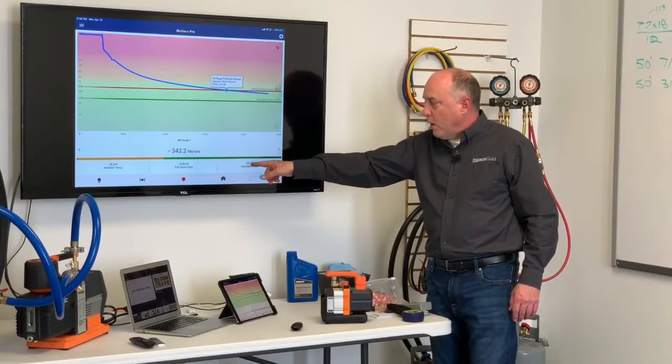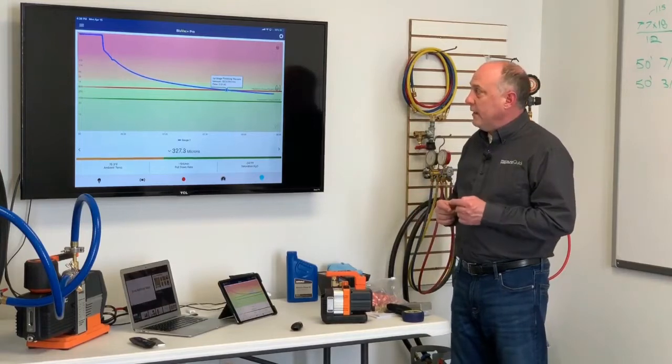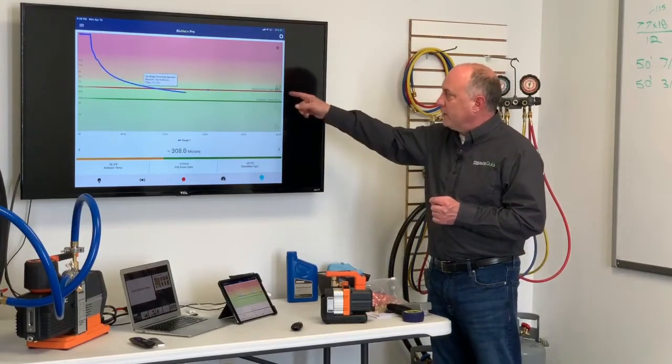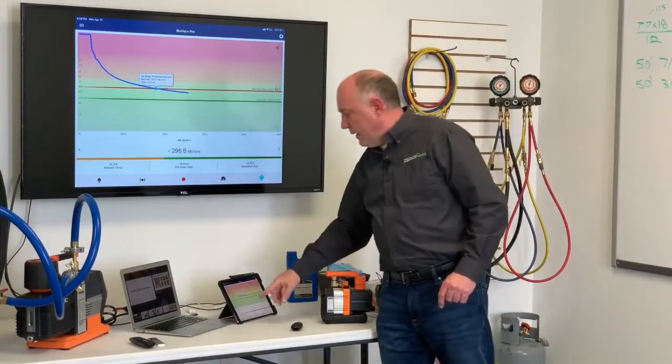This is our saturation temperature. This is the boiling point of water. We're at negative 23 degrees. So again, this system is really nice and dry, and we're coming down quickly on that. We'll give this a couple more minutes to come down. The graph here, when it hits this point here, it's going to rescale. So we saw it rescale there, and we're still on our way down.